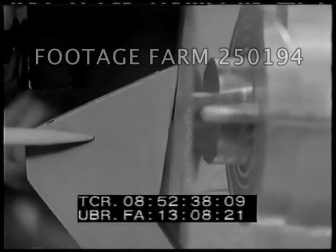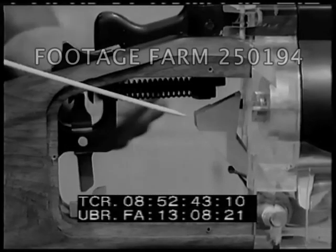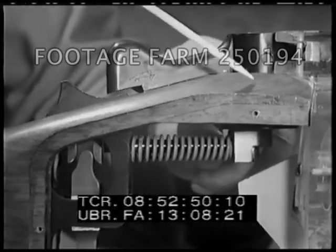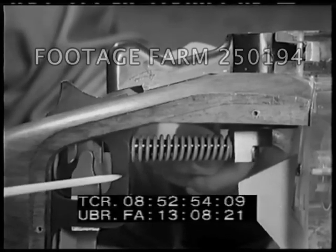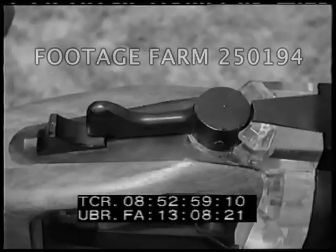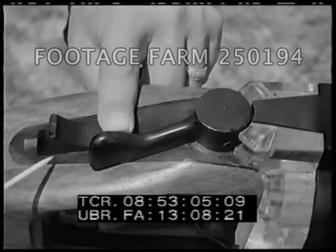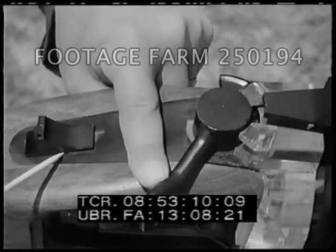The hammer retracts slightly, allowing the firing pin to be withdrawn from the primer. The parts involved during unlocking are the barrel locking lever, the actuator and spring, safety bar, and safety. Unlocking is accomplished by pressing the barrel locking lever to the right. This unlocks the barrel, and at the same time the actuator pushes the safety to the safe position.